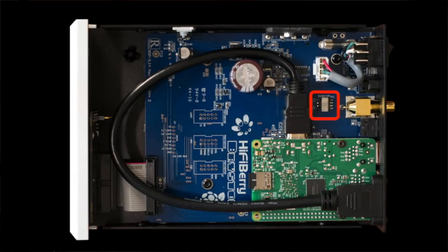I wasn't able to see what components have their own voltage regulators, but my guess would be that the Raspberry Pi, the display electronics and the I2S to SPDIF electronics are separated this way. Some other things I noticed: a transformer provides galvanic separation of the SPDIF output that, by the way, comes in the shape of a very sturdy gold-plated RCA chassis part. The power supply is fused and the HDMI output, which is on the side of the Raspberry Pi, has been moved to the rear of the BDP-Pi by means of a cable.